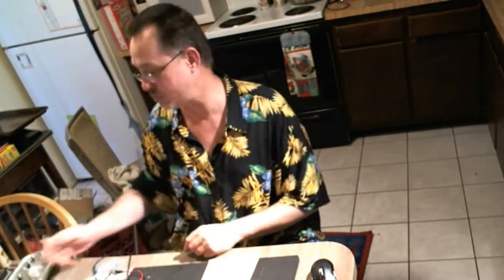If you've got your act together, maybe you have a professional power brick like the Voodoo Labs Pedal Power, maybe you don't need to worry about this. But if you're like me — kind of disorganized, a bit of a hack — you might want to think about adding a polarity protection diode to the circuit.